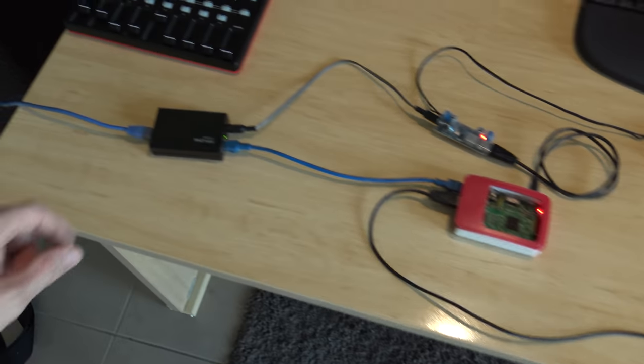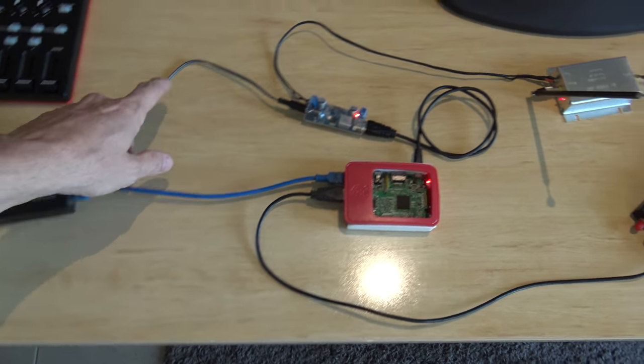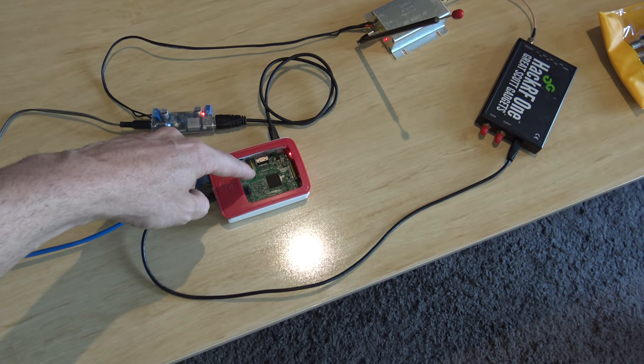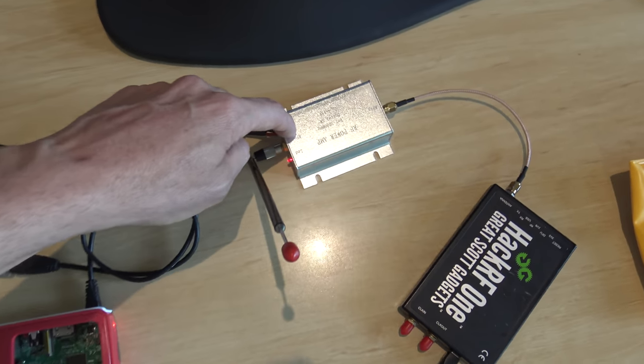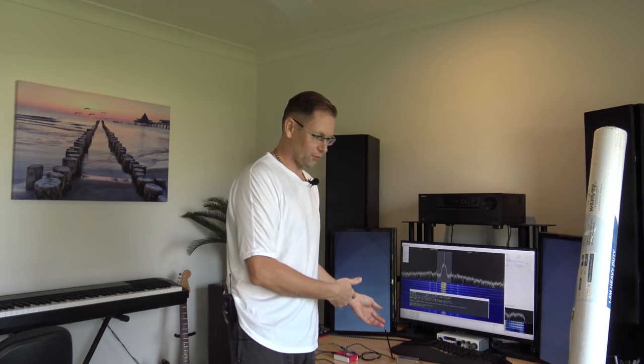To power this I'm going to run it off PoE, taking 12 volts out and putting it into a 12-to-5 volt converter, so the 5 volt runs the Raspberry Pi. The 12 volt side goes into the amp, which would like 15 volts according to spec, but it's going to get 12 and be happy with it. That's just for testing — this is transmitting from here.